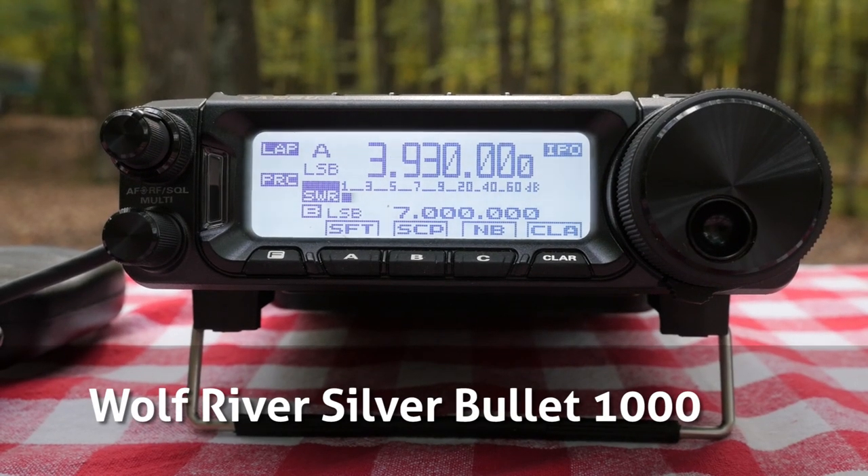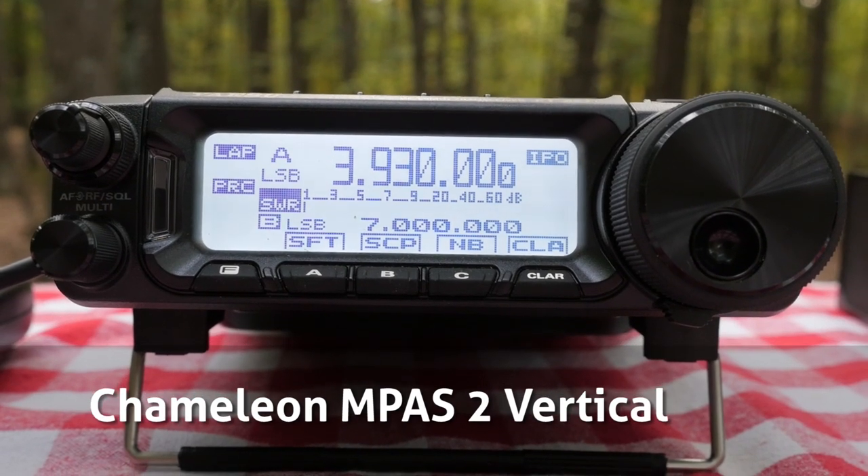Sunday morning, I put both antennas on the 80-meter band to work the statewide ARES RACES HF net. The net control, which was about 150 miles away from me, copied me on the Silver Bullet vertical, which was a little surprising considering verticals really don't work so well for regional or NVIS-type contacts. Tuning around, I then did an A-B comparison on the 80-meter band and noted that the Silver Bullet was about two S-units higher in received signal strength compared to the M-Pass. The general rule is that if the difference in signal strength is enough to make that contact or break the pile-up, it matters.